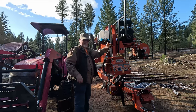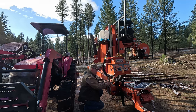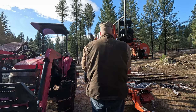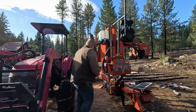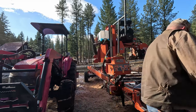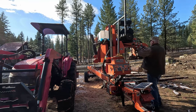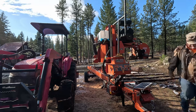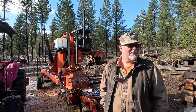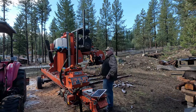Hopefully you can hear me, folks. Let's check that out now. At 11.9, folks. And going down. That's not good. That's at 11.8. Still going down. Well, folks, I'm not getting anything out of that alternator. As of right now, folks, we're dead in the water.